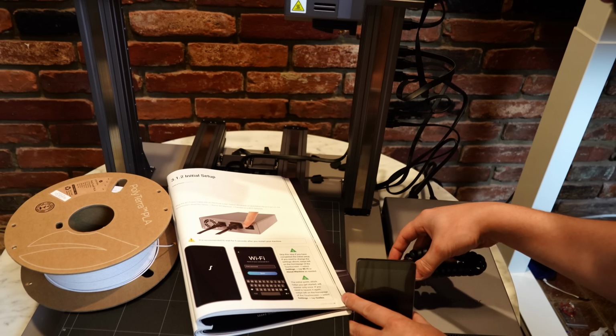Then we've also got this CNC machine attachment, so instead of putting the laser head on, let me just sweep these out of the way. If I had installed these, I would have to undo, you know, 20-something screws to remove these. Then I'd put this down and put those 20-something screws back into this board to secure it to the movable Y-axis. Then you can switch this over to being a CNC machine. And here we have the CNC tool head. So you would just unscrew 4 screws in the back there and put this CNC tool head in instead. Then you can go machine stuff.